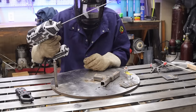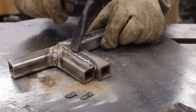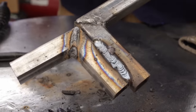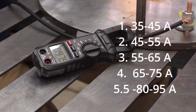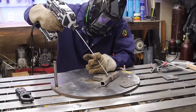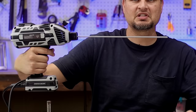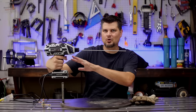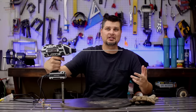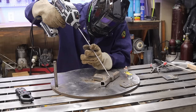Don't forget to pull the trigger. Once I did find the right settings, it started and actually ran a fairly nice bead. I had the amp meter hooked up for those tests, so I'll list the scale and the amperage range it correlates to below. One of the hardest things with stick welding is actually striking an arc — it takes practice, and even more so with a handheld welder. I was trying to hold my hand as steady as possible, and there's quite a bit of movement down at the end. You can see I was able to hold it, but it's just a really awkward position.